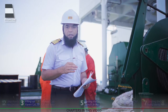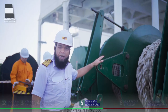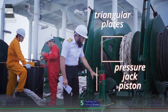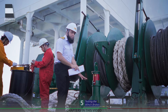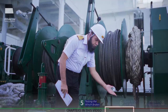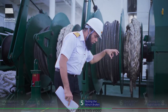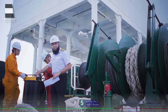Please consult your winch manual and gather all the equipment necessary to perform the brake holding capacity test. For our winches, we need triangular plates already fitted on the flange — you have to turn the winch to bring that point to where these bolts are to be fitted. We have already fitted two triangular plates. Then you need your pressure jack, the top part, and a standpoint. Remember to put all this equipment at the designated place marked for brake holding capacity test, because when applying pressure the force acts both upward and downward, and placing the jack at the wrong point could damage your deck.